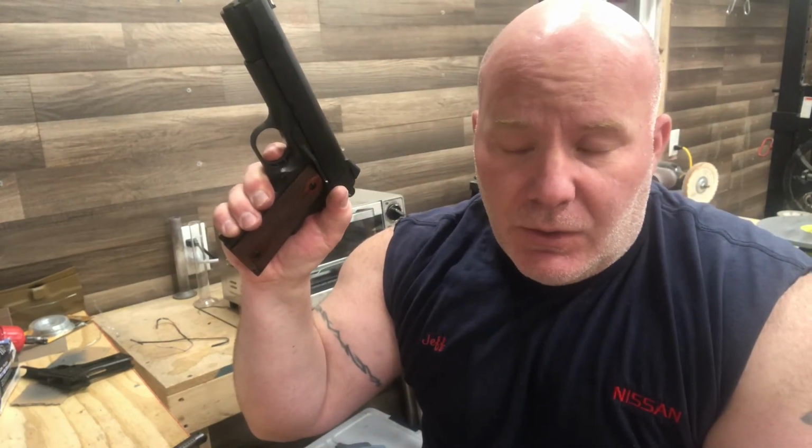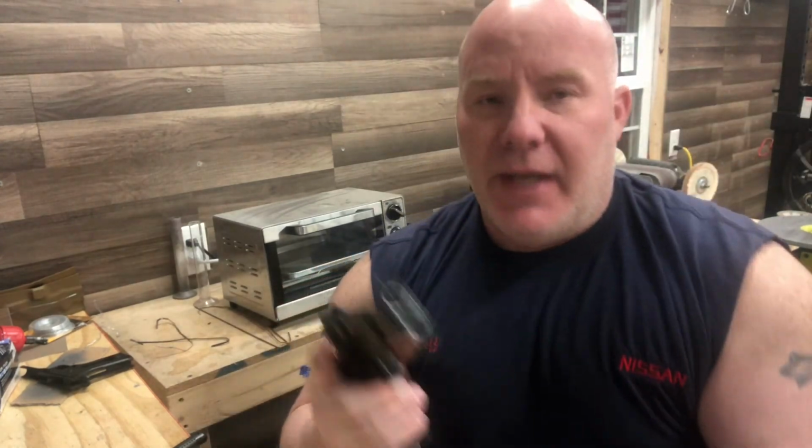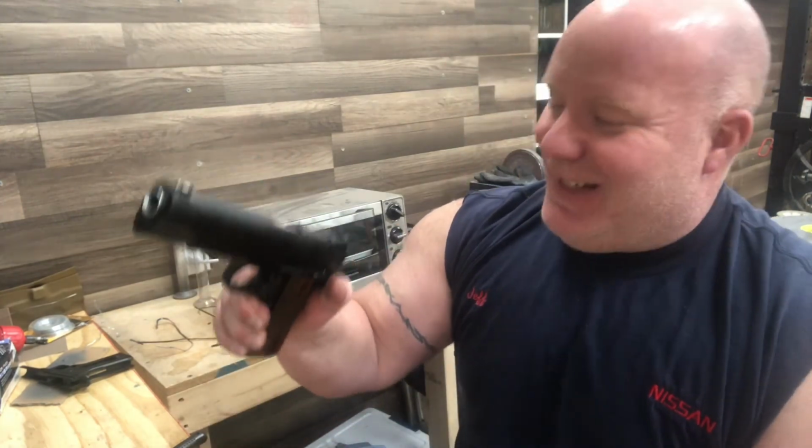Again, I don't do this often. I'm just doing that to prove to you that it can be done. And if they do it the right way, ooh-wee, boy, that's nice. Nice and crisp. And if they do it the right way, with the right sear, that thing will last a lifetime. So, just want to give you a quick update at the end of the video. A 2 pound trigger pull. Yeah, a lot of you are going to say it's too light. I don't care. It's my gun.